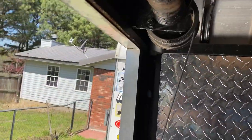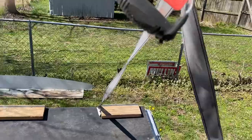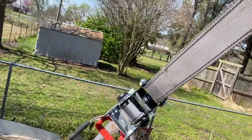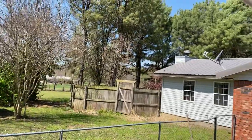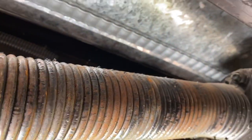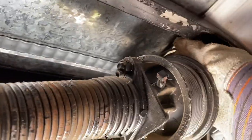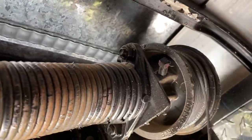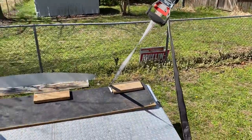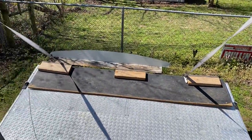This cable, as you can see, is loose. I took my ratchet and ratcheted the door up about a third of the way, and I've got enough loose cable now. I'm just going to go around that one time — there it is. I've made one loop on there, and now I'm going to let this down and see how it feels.